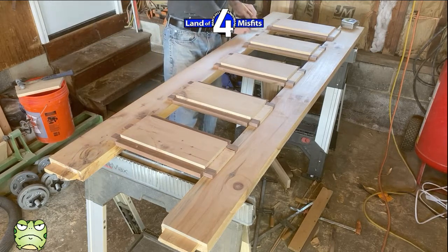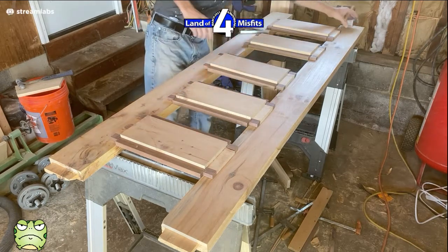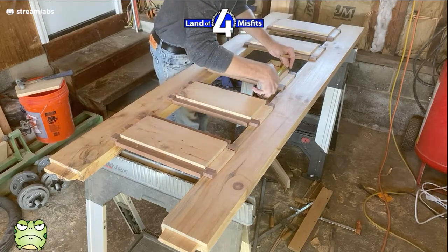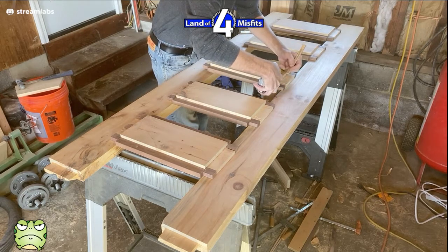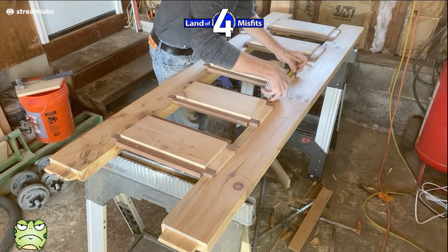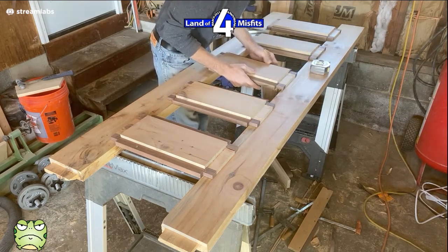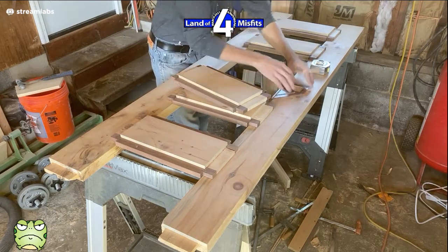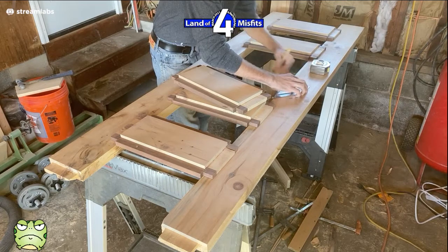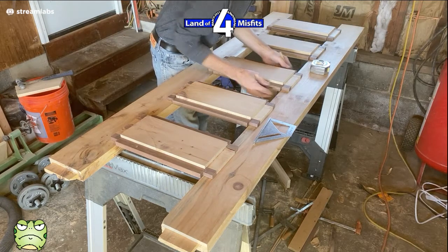And now let's get our center set. So we're gonna actually need to measure on this guy. Do this 2 3/4. Let's actually do it on the 10 in here. So 3/4. That's our center mark. Line that up with this center mark, which we probably will want to continue up. You can see it there. And all of this will be sanded off, so all these pencil marks I'm putting on.